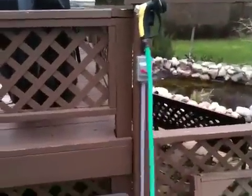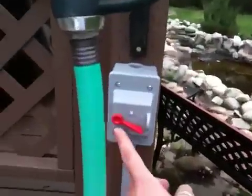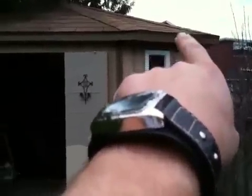It goes over here into 50 feet of garden hose — I just have the end hanging up there. That pump is 12 volts, so I put a switch up here for the pump. The 12-volt wire runs underneath the lawn. It goes up into the shed. You can see on the corner of the shed — you can just catch the corner of that 40-watt solar panel.